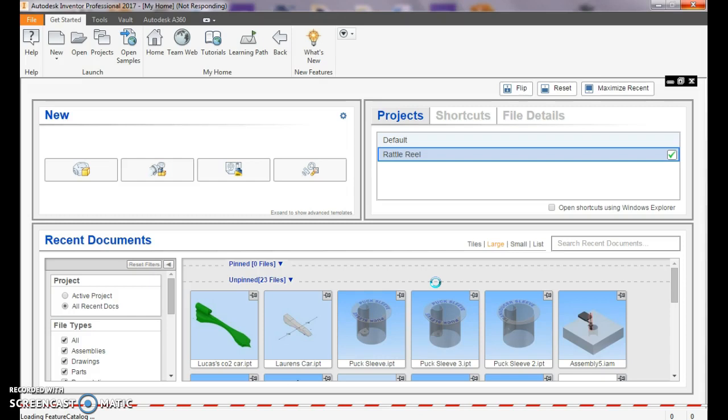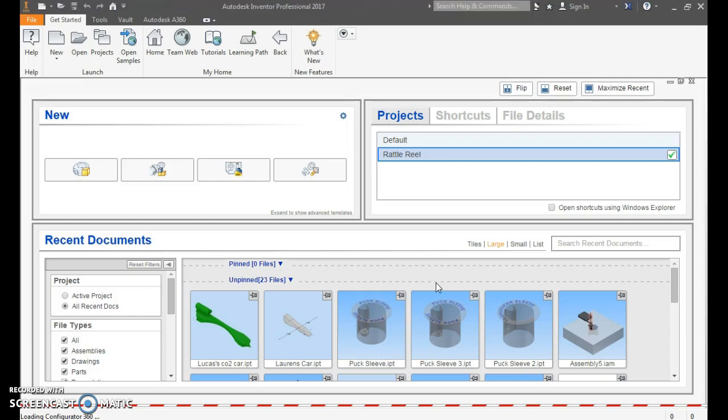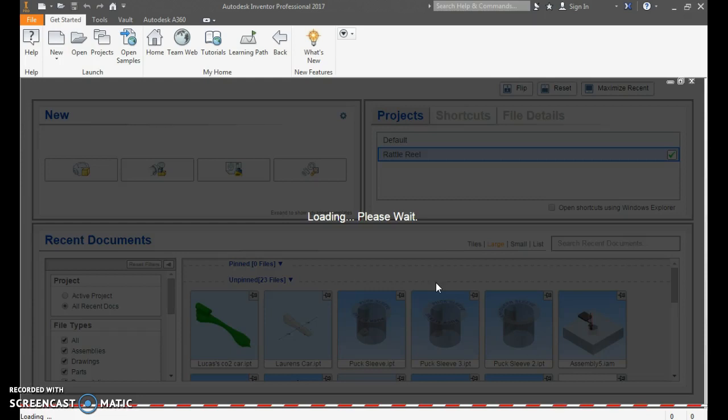And you also need to make an extrusion for the hole. The hole in the back is 0.8 inches in diameter. It is 1.375 inches from the bottom, and it is 0.75 inches from the side.